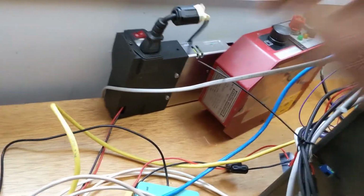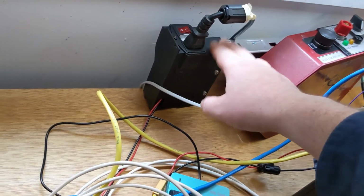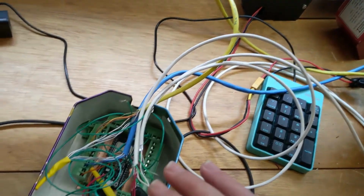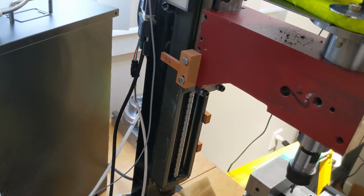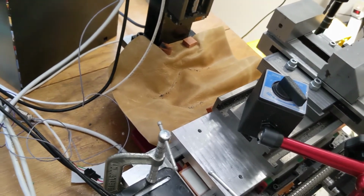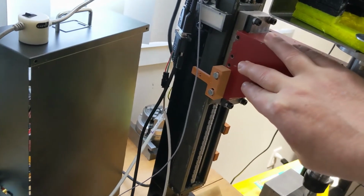And I got my new power supply hooked up, which is a 48 volt Meanwell supply, which is a smaller supply. I'm a little worried it doesn't have enough current for my peak motor performance. But at the end of the day, I'm able right now to do the homing, and it works. But I still don't feel like I've gotten the noise to the point where I can have a high level of confidence that this thing will get back into the same position every time.